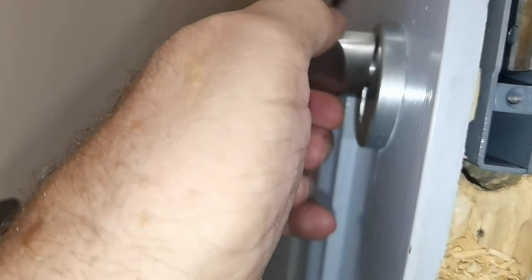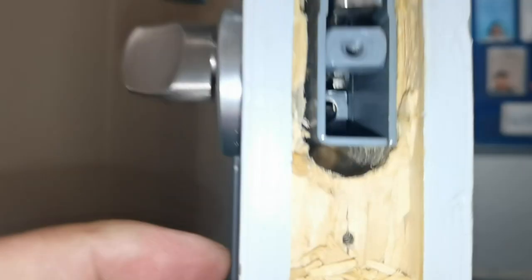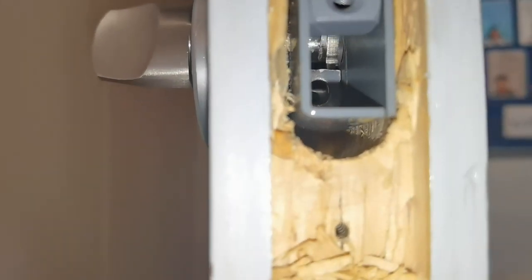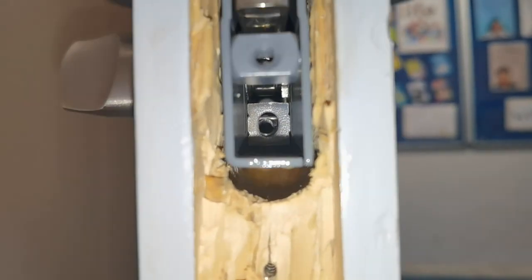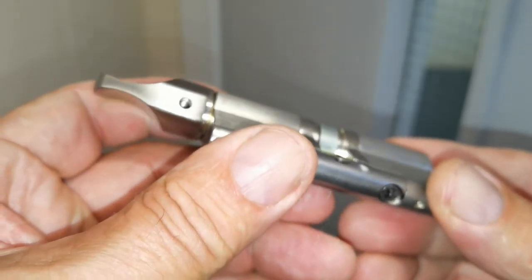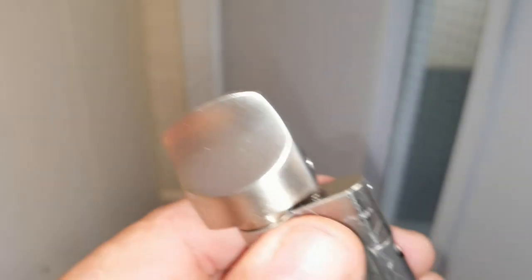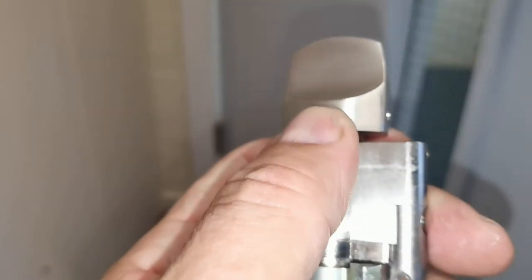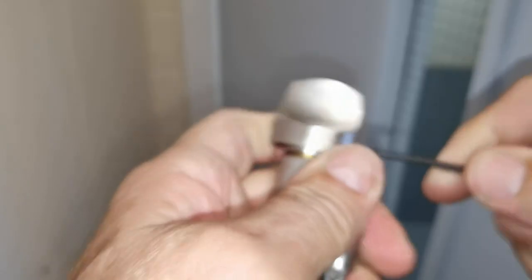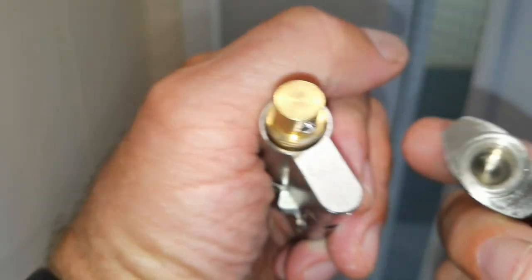Okay, and then we just turn this... oh, maybe not... oh yes, look at that! But I don't have a grub screw because you can see the hole. I'd love to find a grub screw for it. I'll take this old one so I can find one to fit, because the grub screw should be the same size. Also, there are no numbers on this — to get the thumb turn off you can use your thin allen key. Just push that into the hole and it should just pop off. There we go, it's just a push. See — no numbers. Put it back on again.